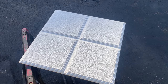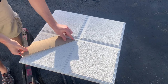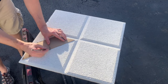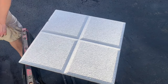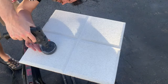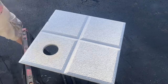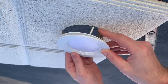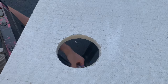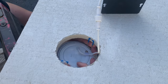I'm installing these in drop ceiling tiles, so I pulled them out to drill the holes. I made a template to make sure all of the holes were located perfectly. If you're installing these in a drywall ceiling, you'll have to make a mess in the room. With the holes drilled in the ceiling, push the box through. Then push up the spring-loaded clips on the sides of the light and push the light up through the hole to install it. The clips will secure it in place.